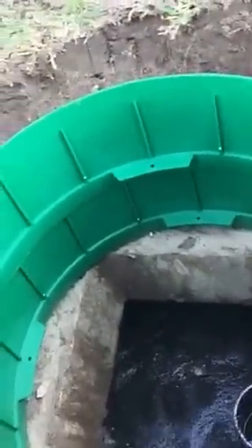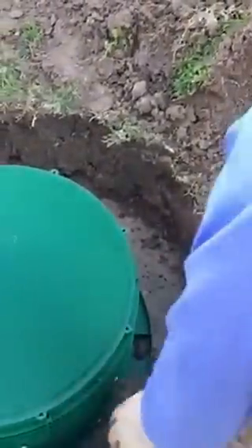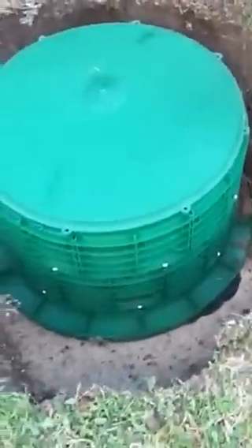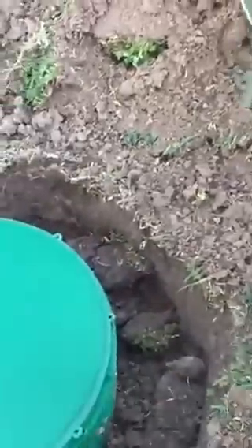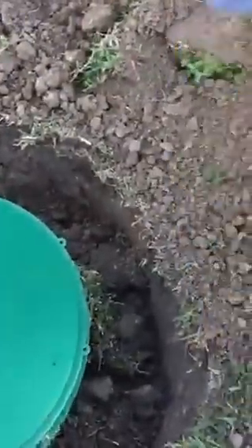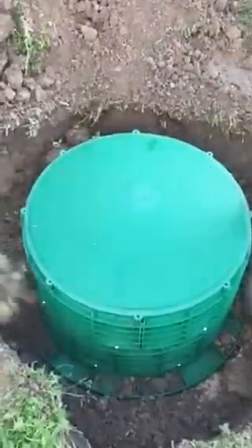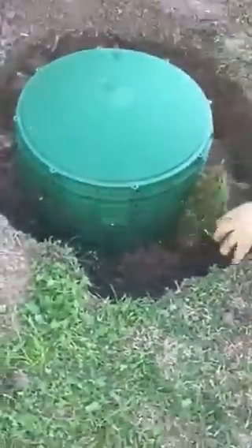Move it over a little bit, there you go, then you put the lid on. Another reason you want to dig it wider is when you're backfilling, you don't want just one inch of clearance — you want to be able to put that dirt in there. Because of the ribs here, the dirt will actually hold it better. We don't backfill it all at once — we fill it up about halfway first. You want to do it all the way around and then compact it, right there.